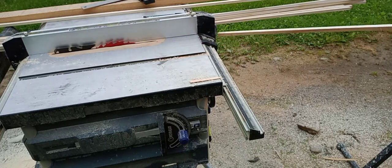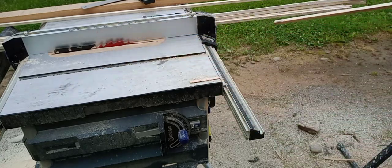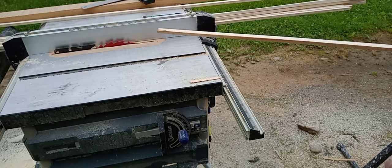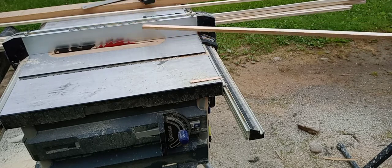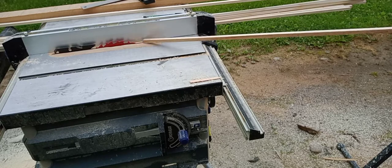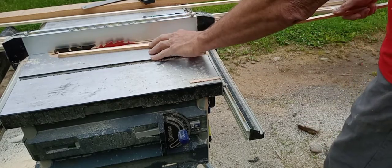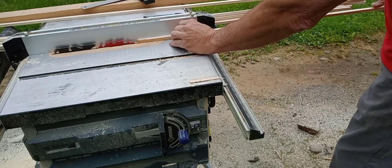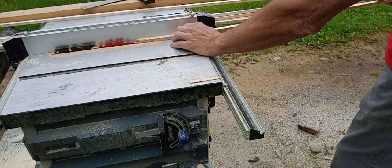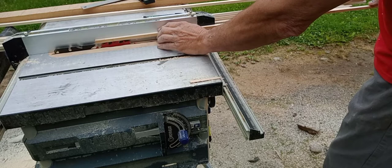I never stand directly behind this — my face, my head. The only thing that is directly in line is my hands from my wrists down. Nothing else is in line with this blade. So, a couple of safety tips. I'm not saying the way I do stuff is the safest way, by any means — put your safety guards on — but I'll give you some safety tips to keep this stuff from kicking back. What I'm doing back here is I'm lifting and pulling out, just a little bit to put some pressure down onto the table and a little bit into the fence. Then once it's in about this far, you can just ease up on that and hold it down with your fingers.